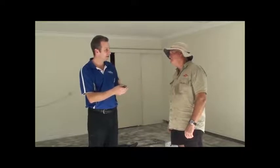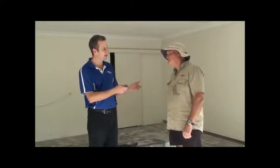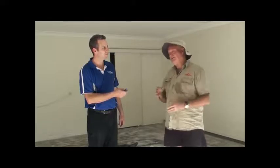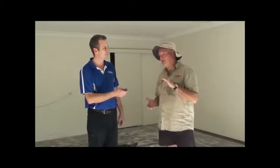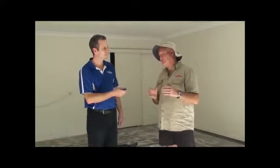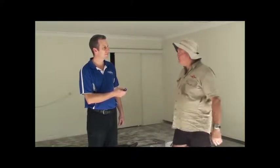Yeah, just on that flake, if you're talking about 250 microns or even 300 microns, if you're allowing for more porosity, then you're also budgeting, what, 10 square metres per 5 kilo box, or are you allowing more than that? When I'm casting flake, I always budget on 10 square metres per 5 kg box. Different manufacturers make different size boxes of flake, and it all becomes a bit confusing, but I budget on 10 square metres per box of flake, and I find that's always enough. We often have some left over, or it allows us to really just do a full flood of flake on the floor.